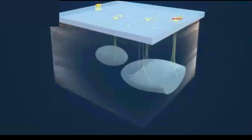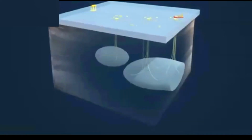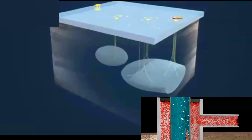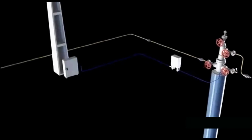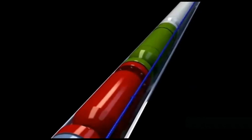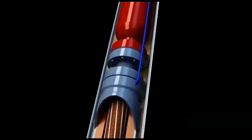It can also be used in wells that are deeper than those that can be serviced by the sucker rod pumping system. Because of its need for repeated maintenance and its dependence on a source of injectable gas, however, gas lift is the second choice for artificial lift. Finally, the electric submersible pump is reserved for wells either onshore or offshore with high production rates that can justify its relatively higher cost. Like gas lift, it can also be used in deep wells.